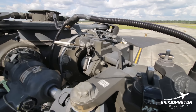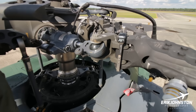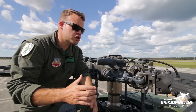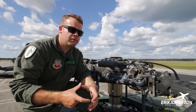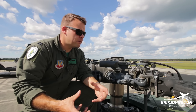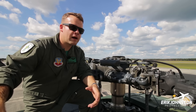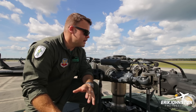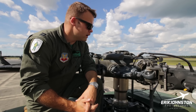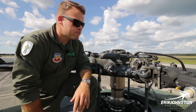Because of the fully articulated rotor head, Sikorsky developed an elastomeric bearing inside the rotor head for each blade. That greatly reduced maintenance work — traditional rotor heads had metal bearings that had to be greased, serviced, and eventually wore out. The elastomeric bearing is essentially a large piece of very tough rubber that allows the blade to move around without needing a ton of maintenance or constant servicing.